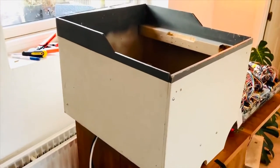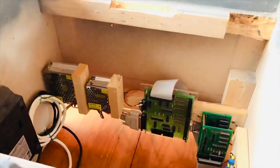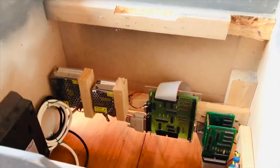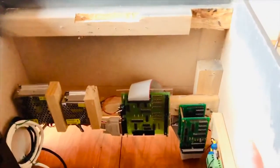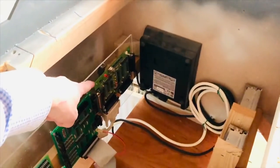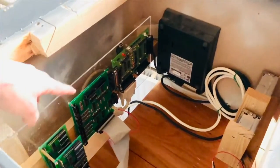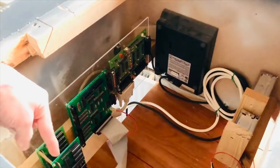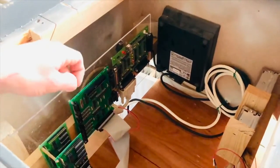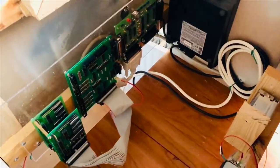I took the pedestal out yesterday and did the same. Early on I just had one MasterCard connected with a very big parallel cable to the main instrument panel, and then I had four display cards — you can see two of them there. Yesterday I installed an additional MasterCard and an OpenCockpit expansion card, so now it can be USB connected. I could do with five display cards, but with only one MasterCard the maximum you can connect is four, so I'm hunting to find a fifth display card.